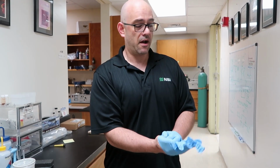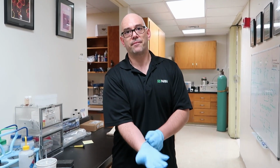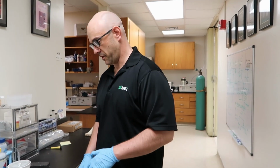And so right now I'm going to be practicing alignment with the electron beam microscope. Alignment is when you write patterns. This is about drawing very tiny patterns. When you write patterns, you have to change the magnification and also the current. And when you do that, the beam shifts. And so you need to align the beam each time you change one of these parameters. That's something that I'm going to be practicing today. And that's what we're doing.